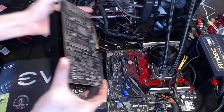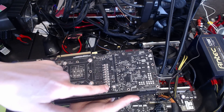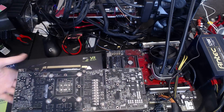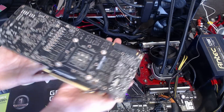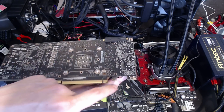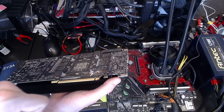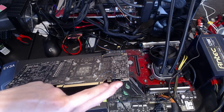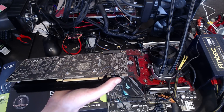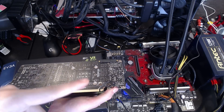So let's just pull it out of the system. You can clearly see that's a 1080 Ti PCB — it's an NVIDIA PCB, we have the 8 mounting holes, the Founders Edition rounded edges, 8 plus 6 pins. The problem is you may notice that the PCIe slot connector right here is kind of chewed up. Basically when I first got this, that entire area was just a giant scorch mark, and there was a short circuit from 12 volts to ground from the PCIe slot. That part of the connector is now gone because it was basically vaporized.